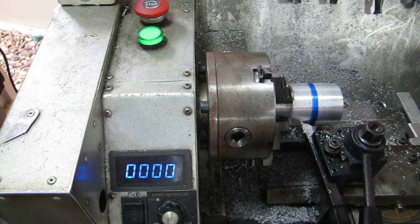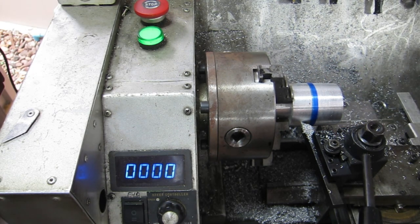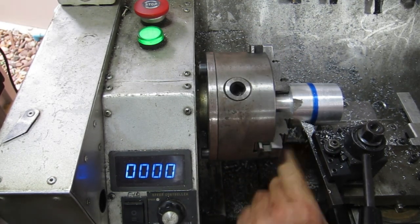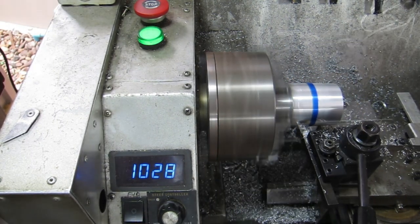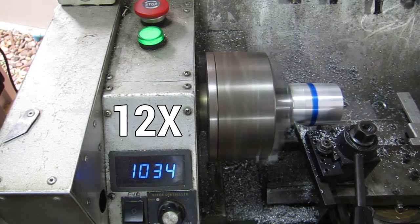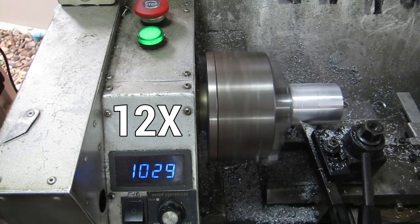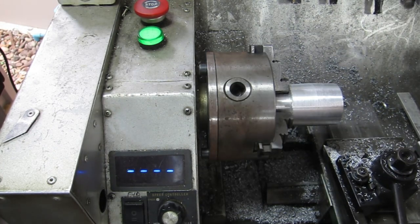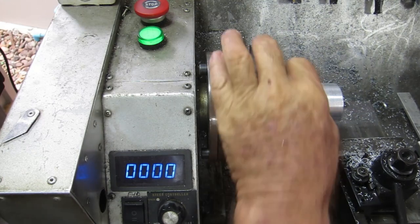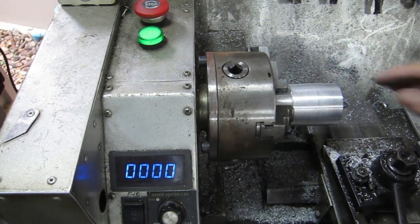I've been trying to close that damn door — it's just hard work. I machined this end to one degree and it just didn't look enough so I've changed it to two degrees. I've now set my DRO to zero at the front edge of this jaw so I'm going to put the same taper on this end as I've got on that end. I really do wonder about myself sometimes — I don't know why I bothered setting that DRO because this wasn't moving, only the slide was. I nicked the jaws a couple of times, so I'll get some sandpaper and dress that up a bit.